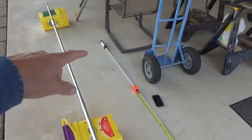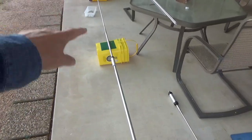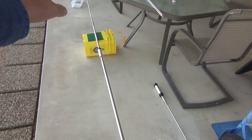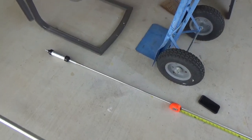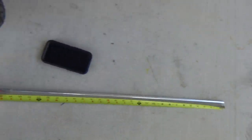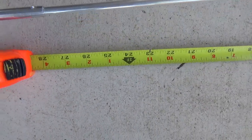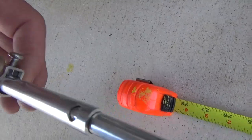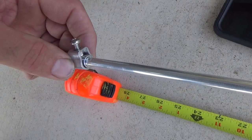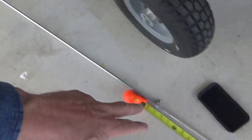Right here, what I'm working on now is the 10 meter horizontal radial. The way this antenna works is this actual portion of the antenna is the 6 meter portion, and that's a co-phasing coil right there. On the 10 meter section, they actually work off of a horizontal radiator. The way you do this is you measure 27 inches right there, and then I'm going to add this little fitting which has a nut inside of it. This is the loading coil for the 10 meter section.